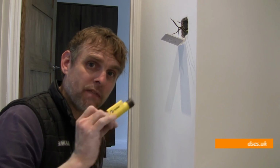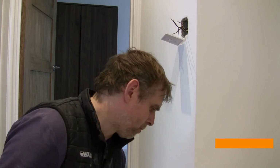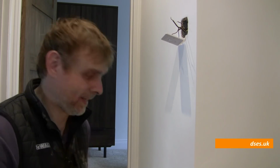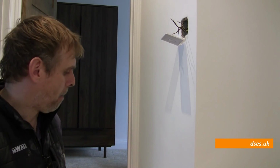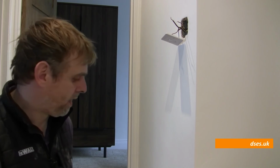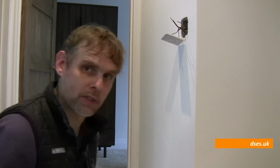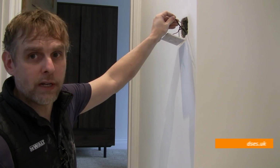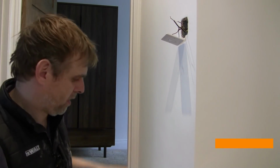Obviously today this thing has been fairly instrumental in getting us out of trouble, but it turns out there's another thing we need it to do here today. Our initial verification on this site has determined that there's a fault with our lighting cable. We think that Nob the Builder, can he whack a nail through it? Yes, he can, as he has perhaps punctured our cable with a nail, using his nail gun when he put the skirting on. We've got no continuity here on the grey 3-core that goes from the switch point to the one downstairs.